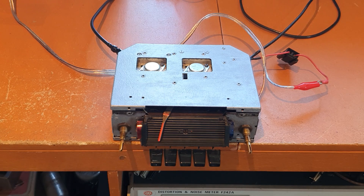Many, many resistors were replaced as well — a lot of them are 10% resistors. But many showed more than 10% drift, going high as usual, really high in some cases. The weird thing was that when I desoldered them their values changed again, and they were still more than 10% out. This just shows how unstable they've become. In a car environment subjected to high temperatures, low temperatures, and high humidity, it takes a real toll on components compared to a radio in a house — far fewer need replacing in domestic use.